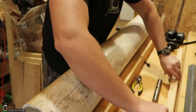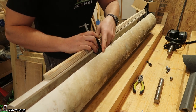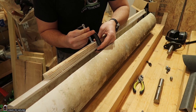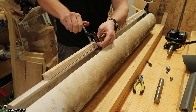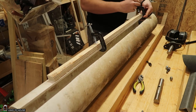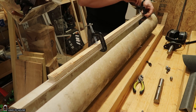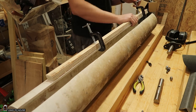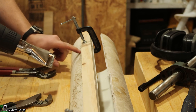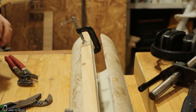We'll see how well it's going to work. I have heated up PVC to bend it, but not to this scale. Let's try out some C-clamps — maybe that will be effective at not melting my regular wood clamps. The thought is, if I can get this piece of wood to give a straight edge so whenever I bend the PVC up it will not have any problems. My heat gun goes up to 900 degrees. I'm going to heat up this edge and then use these pliers to see if I can coax this around. Let's see what happens.